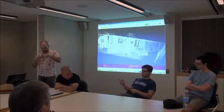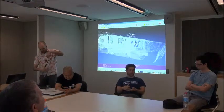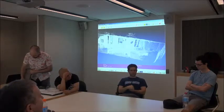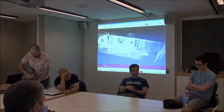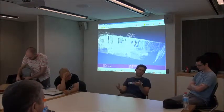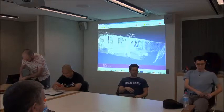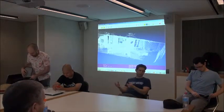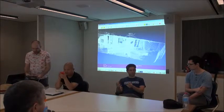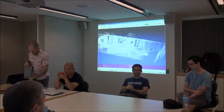The technology actually started with a spinning version on a motor, which we mounted on a vehicle, because we're a robotics lab and we were first looking at this as a 3D perception system for earth-moving and ground vehicles. It's exactly the same software we use. Then we had some interest in mapping caves and things like that, so how could we make it more lightweight and simpler, something you can carry around in tough environments? Brainstorming through that, we came up with the idea of the spring. The advantage of the spring is that it's mechanically simple and lightweight. With a motor you'd have a more complex mechanism, it would be heavier, use more power, and you'd need a slip ring or other parts that tend to fail more often than a spring would.